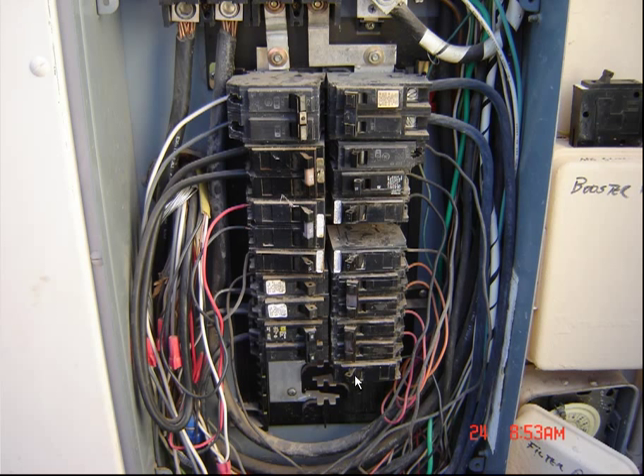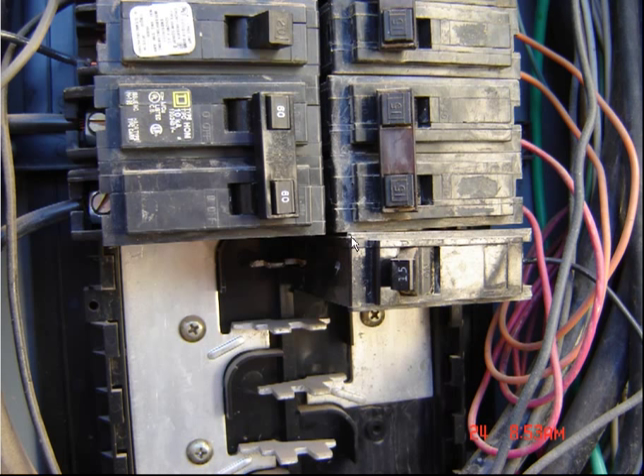That's a good fit there. We're going to be talking about this breaker here in a minute. I had to change that out, but there's a GE breaker, there's a GE breaker. There's a couple other ones in here I don't even know what they are, but they're not fitting correctly. I'm going to end up putting all new Homeline breakers in on this panel. So this particular breaker here, as you can tell, doesn't seat right, doesn't fit down into the busbars correctly. I didn't even bother looking to see what it was — I'm assuming that it's a GE breaker.